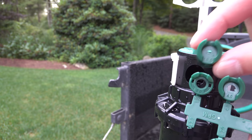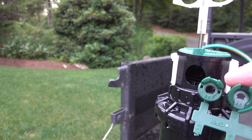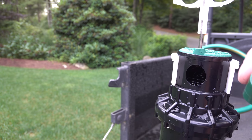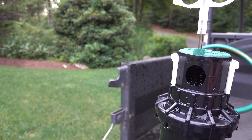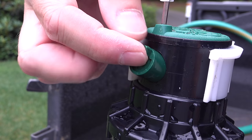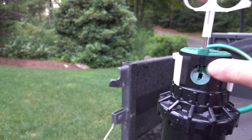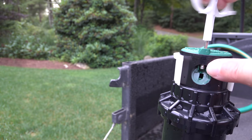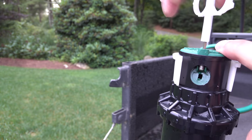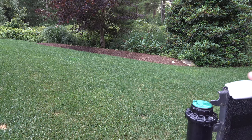There's a little kit that includes all different nozzle sizes — there are sizes in the middle that fit every situation. If a zone isn't getting enough water and it's putting down half a gallon per minute, double the nozzle size to one gallon per minute and see how you do. To swap a nozzle, take your new nozzle, put it on at an angle pointing it upright, gently push it into place, and re-tighten the adjustment screw just enough to hold the nozzle in. Then yank that little clip off and your sprinkler is ready to test.